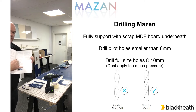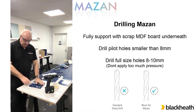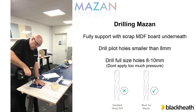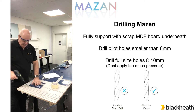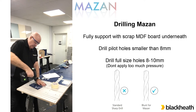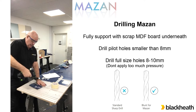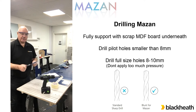That's then suitable for acrylics. What we've done here just to emphasise this point is in the scrap piece of material we've drilled the pilot hole. We've now got a drill that is a new, sharp drill bit. Unfortunately, wrong type of drill and it has literally just shattered the Mazan itself. So it really is important that we use that blunt drill bit.